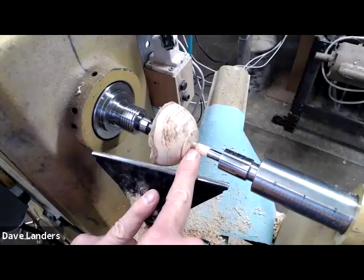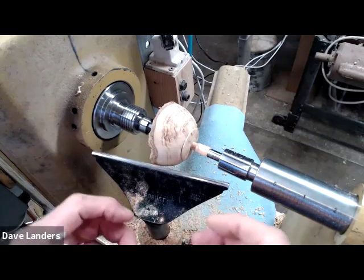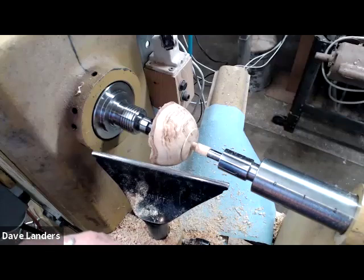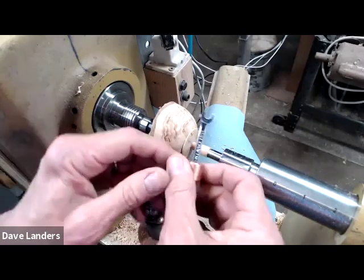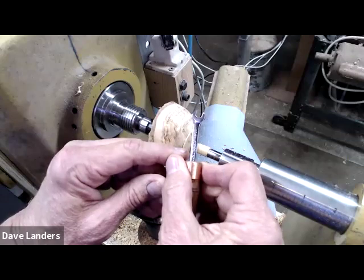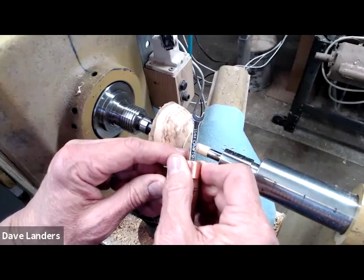I don't want exactly a quarter inch. I want something a little bit smaller because I don't want to have to press fit this into a teeny spindle. I want to have some room to play with it. It's really not a structural piece. It's not a structural tenon. It's just registration. So this wrench is a 15/64 wrench. So slightly under a quarter.